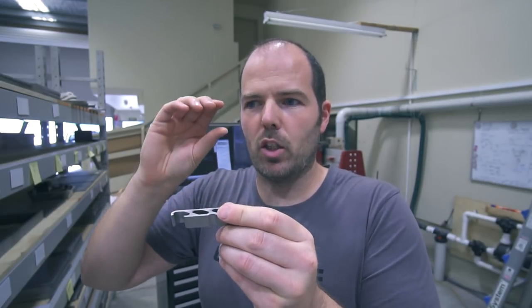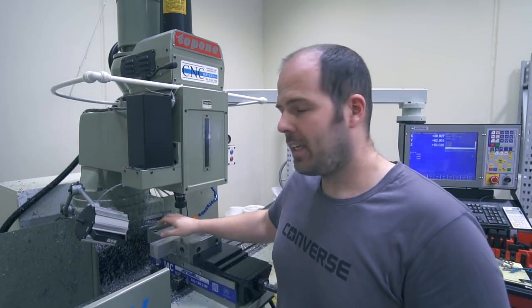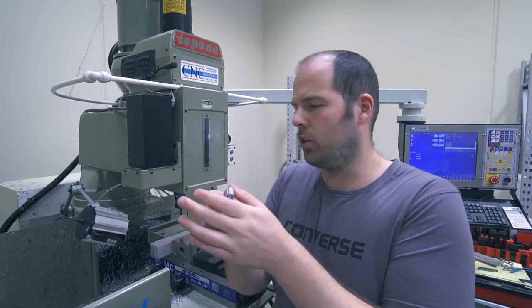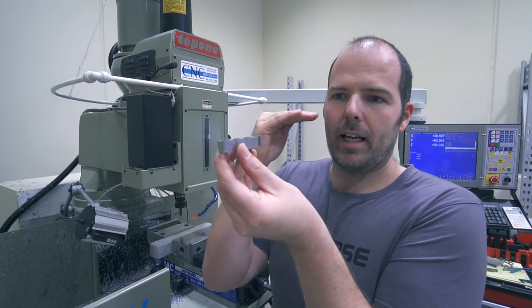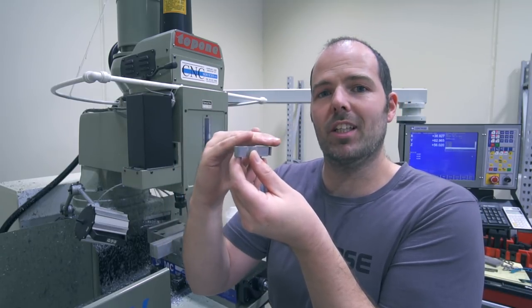What I'm going to do is on the milling machine now, we're going to face it. We're going to make it a standard, maybe say, 11 mil thickness and then we take it from there. What I've got in here is basically what we call a set of soft jaws. It's basically a way so I can clamp this bottle opener down at the bottom and just mill over the top of it and skim the top and get that side nice and clean.